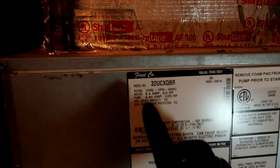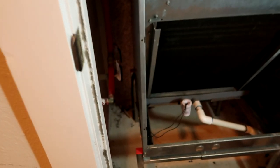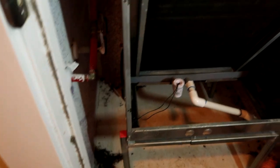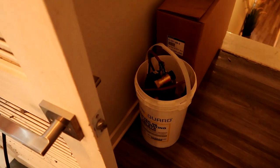What's up everyone, long time no see. We're gonna have to replace this first company coil today - it's a little slant coil and it's been a repeat offender. We'll charge it with refrigerant and then four months later it'll be empty again. We brought out the sniffer, the freon refrigerant leak detector, and it rang off heavy in two spots. You can see the oil right there - that dark spot - and over here too, so it's two big spots. I'm gonna have to take this coil out and replace it.